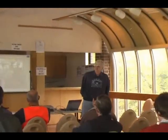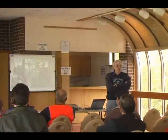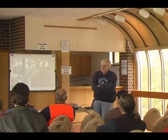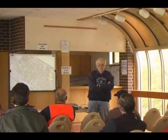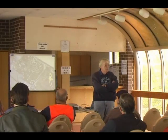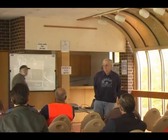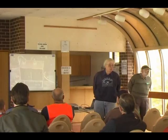In Melbourne, basically, we've moved off 400 megs. 400 megs is still available for TV if you wish to use it, but in Melbourne the RTV repeater is used for that purpose, and basically we've only got one channel left on 70 centimetres. In other parts of Australia that may be different, but most of us have moved up to 1.2 gigs and higher. In fact, all of our input signals are currently on 1.2 gigs.